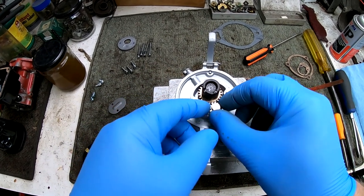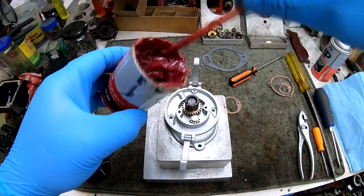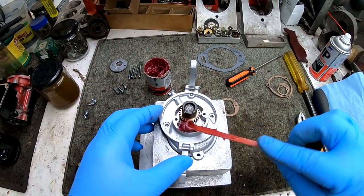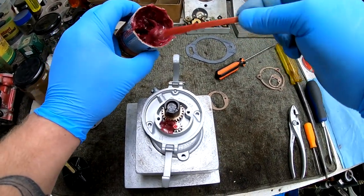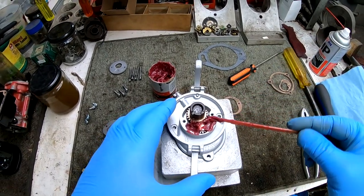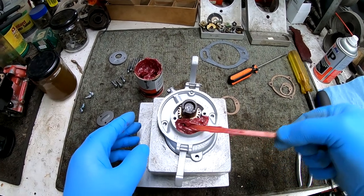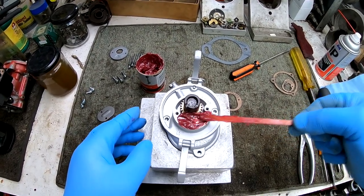Now this is the pinion gear on a left-hand rotating magneto, which would be for a diesel. There is a mark on the back of that rotor gear that says L. So you would align the notched tooth on the pinion gear with the L of the rotor gear. But this is a right-hand magneto for a gas tractor, so we would align it with the R notch. There's a small beveled tooth, machined at an angle, and that's the tooth on the pinion gear that you align with the L or R, depending on if it's a diesel or gas tractor, on the rotor drive gear.